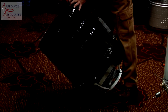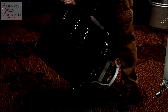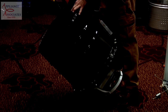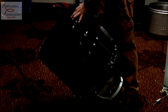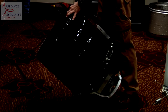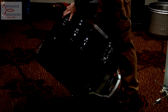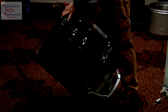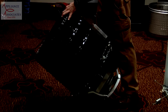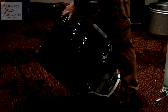Yeah. Unfortunately. Anyway, what I'm going to do is flip this over and show you the bottom half of it. The hub that sits right there has got a cork backer. That cork backer is so this metal does not ride on the aluminum hub metal. Otherwise, we'll start a wearing process. There are 4 bolts that hold that tub in place, and then there are 4 other bolts that hold the hat in place, with addition of the one on the top of the shaft. Okay. Any questions here? No? I know y'all can't see it.